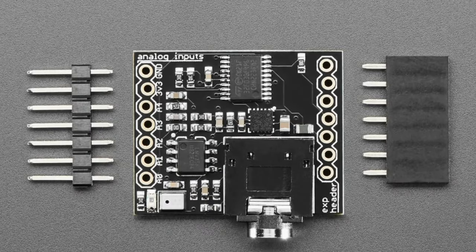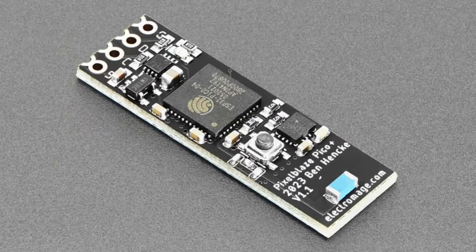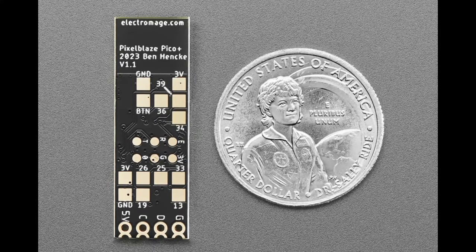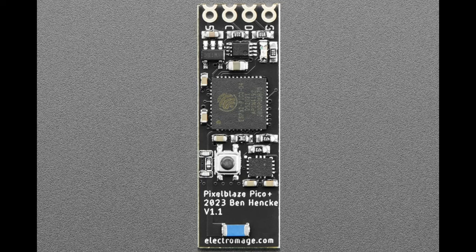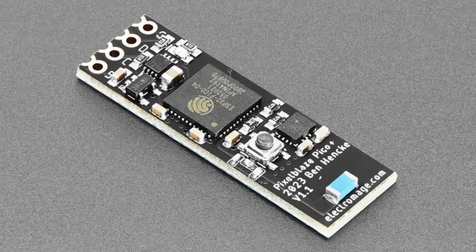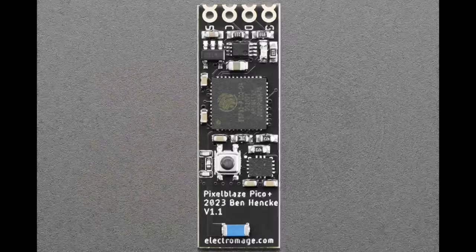They have twice as many sensor boards in stock. Next up is the Pico version — if you're doing a tiny project, maybe tucking it into a shoe, a wearable, or a prop. It's still got ESP32 with a little Pico chip, level shifting, a button, Wi-Fi control, the web interface and app — but instead of a large board it's really minimal. You give it 5V power and ground and get two NeoPixel strands or one DotStar strand output.